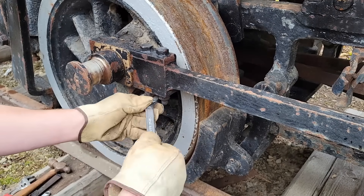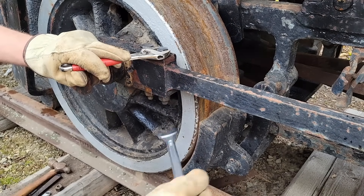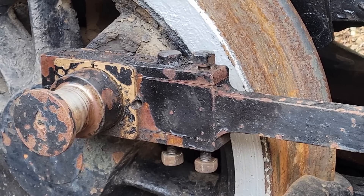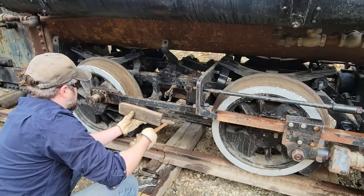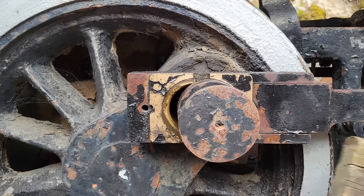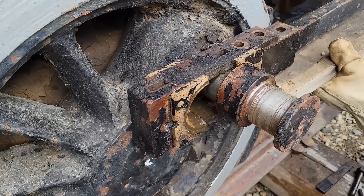To be in tram means that all the wheels of the locomotive are square to each other, front and back, and side to side, and perfectly in line with the cylinders. If an engine is out of tram, you may encounter binding like what we see with the left side rod. Operating or even moving an engine that's out of tram can cause excessive wear and should be avoided wherever possible.